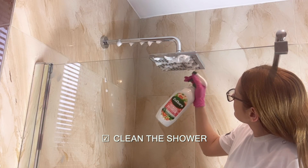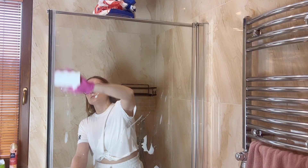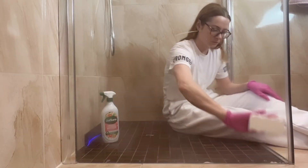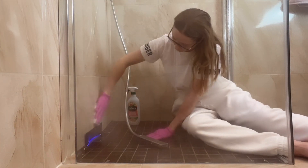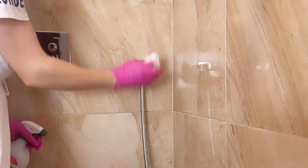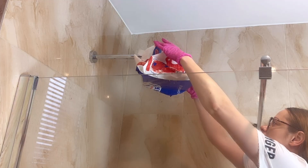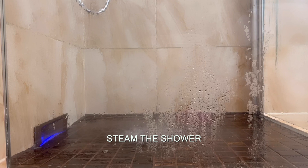Although your shower is designed to keep you clean, it can actually become dirty quite quickly if not cleaned properly and regularly, building up with soap scum, mildew, and bacteria. I started by soaking the overhead shower head with a limescale solution using a plastic bag to cover it and let it sit while I tackled the rest of the shower. An alternative is grabbing an old towel, dampening it in vinegar, and wrapping it around the shower head. Spray limescale remover all over the glass surfaces covering the walls, shower floor, and other areas — you can also use vinegar, as it helps dissolve soap scum and mineral deposits. I prefer a magic eraser or kitchen sponge over a microfiber cloth when it comes to scrubbing down stubborn buildup.